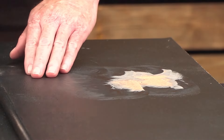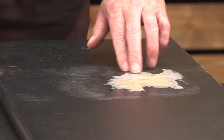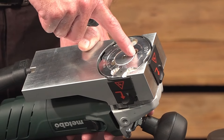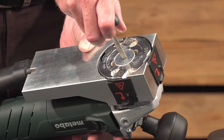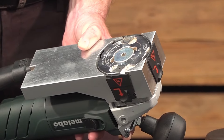As you can see, we're just going lightly through the rubber coating, making it smooth from that textured finish. Going over it a few times, you can actually see the primer underneath. Now we're going to go for maximum — from 0.1 past 0.2, all the way to 0.3 — and we'll show you how aggressive the machine is at that setting.